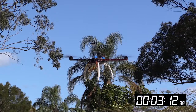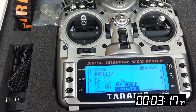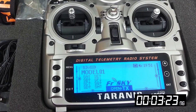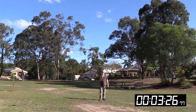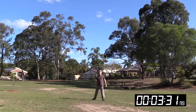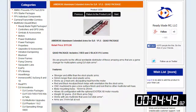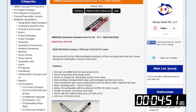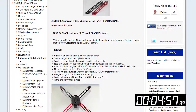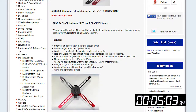I'm running in GPS mode. One thing I like about the Taranis system is I can monitor — along with the FrSky FLV-SS telemetry module — the LiPo battery volts right here on the Taranis screen. It's currently at 11.6 volts. I'm using the AimDroix extended aluminium arms with F450 boards, so whilst the central boards are from a 450, these extended arms actually make it a 550 motor-to-motor.